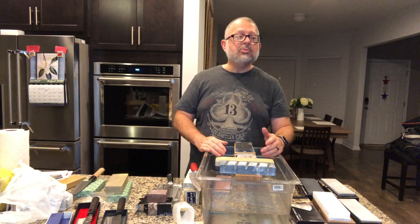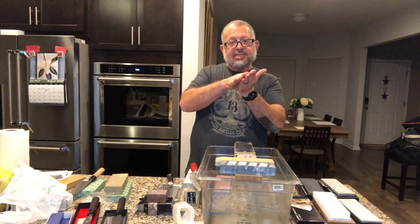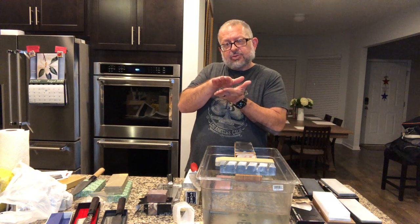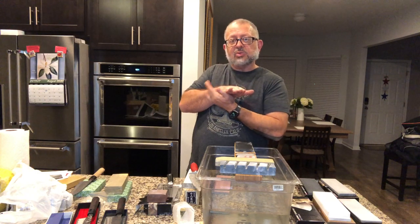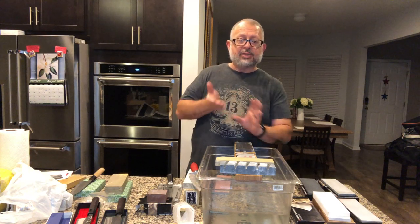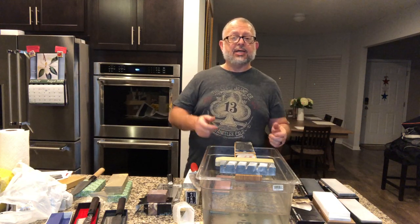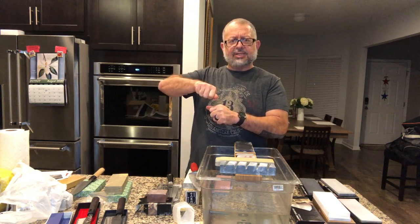Let's imagine we took a piece of wood and you sat on it and I dragged you. That wood would be sanded on the asphalt, which has nodules on it, and so does the sidewalk. As the wood scrapes through the bottom and gives it an edge, you'd see wooden frays sticking off the bottom, and that would be our burr. When you turn the knife over and sharpen the other side, the burr itself is going to flip over. It happens a lot faster on the second side, because if you take a wire hanger and wiggle it back and forth, the first one's kind of hard, then it's a little easier, and then easier, and it snaps.